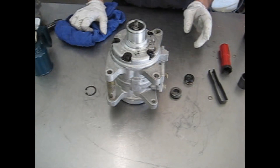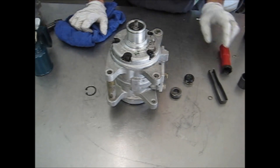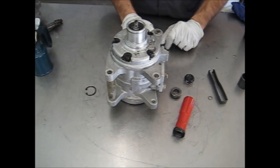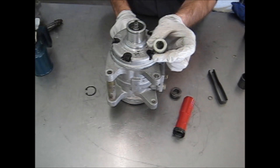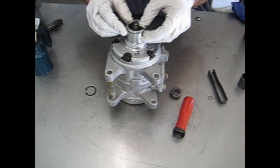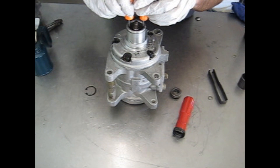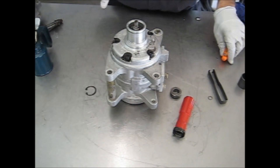We've re-torqued our cylinder head — new brass washers under the bolts, torqued to 23 foot-pounds. Now, without the special installation tool, I'm going to have to work around this a little bit. It's very helpful, while this is off, to know exactly where the flats on the crankshaft are. If you need to make a little magic marker mark on the front cylinder head as a reference point, that's your best bet. You can see there are two flats machined onto that — mine are directly at 12 o'clock. So I've oiled the seal up, not touching the carbon. Using a couple of screwdrivers and pushing on the metal caged part — do not push on the carbon part, it will break really easily — I'm just pushing on the steel machined tangs and sliding it straight down. It engages perfectly on those tabs.